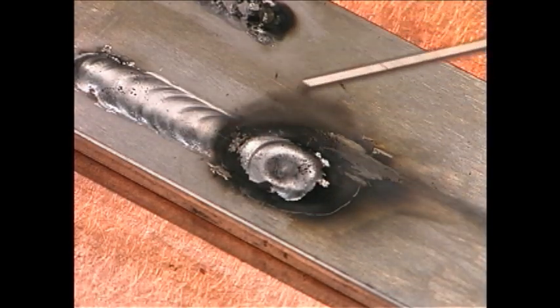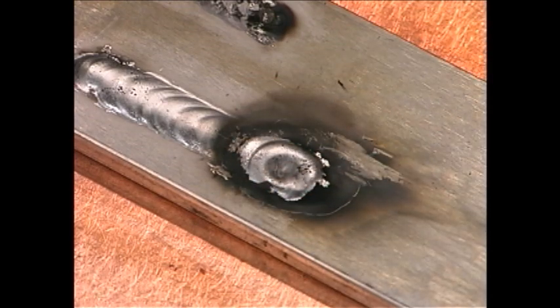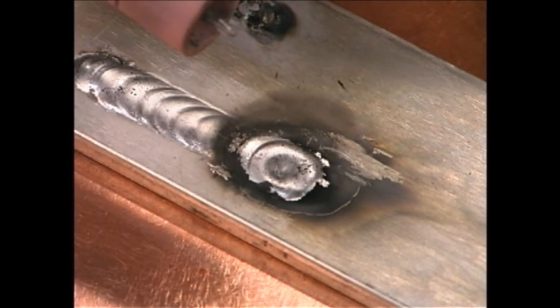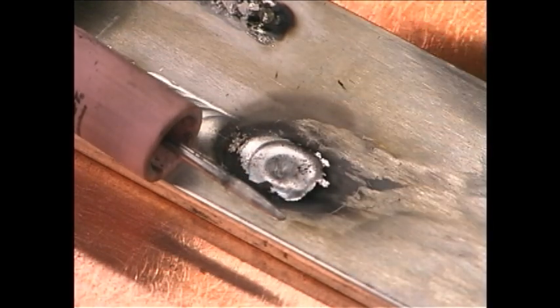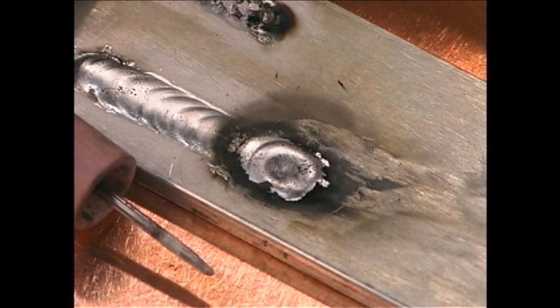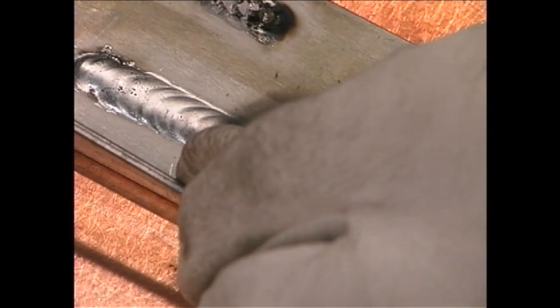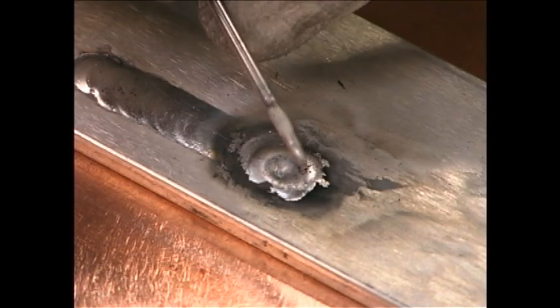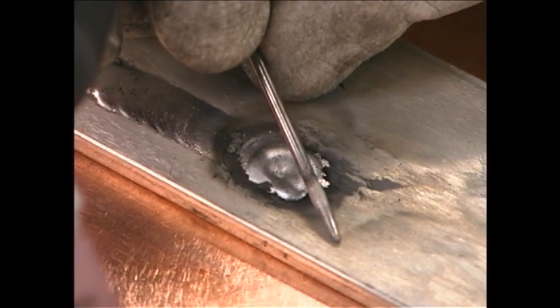I've got a mess on my hands. Let's take a close-up look at what the problem is. You can see what a mess it makes of the weld area once that electrode gets contaminated — there's a big black smudge around the weld. The problem is that when I touched the filler rod to the electrode, the filler rod actually melted and parts of it adhered to the tungsten electrode. Until I clean that up, I'm just not going to be able to make a nice weld. A lot of people try to kid themselves — they think they only contaminated the tungsten a little bit and will weld just a little bit farther. My advice: don't. If you have the slightest contamination, you're just not going to be able to make a nice weld bead.